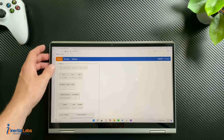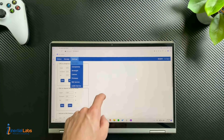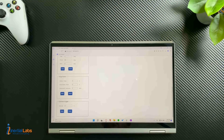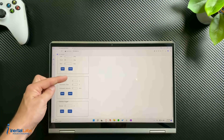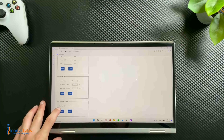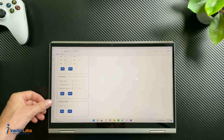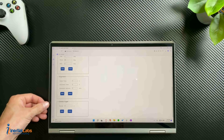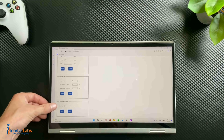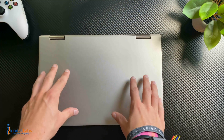Next, go to Settings and then Geometry. Scroll down to the bottom — you'll see Alignment and Camera Trigger. Make sure your alignment says 5, 4, 4 and your camera trigger is at 5 seconds. We recommend a camera trigger period of five seconds if you're flying at five meters per second. Since camera trigger period and velocity are inversely proportional, if you go at ten meters per second you'll want to bump this down to 2.5 seconds.